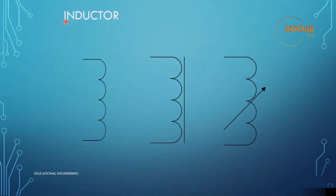Now if we look here, we can see the inductor symbol. We must point out that if there was an arrow, the inductor would be variable, as we mentioned earlier, based on the symbol. Let's try to describe the inner structure of that inductor. We can see that it consists mainly of a coil of wire, or a coil of wire with something inside the coil. As a brief introduction to inductors, you need to understand that inductors store electrical energy in a magnetic field that is formed around the coil here.